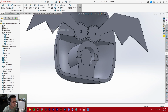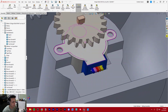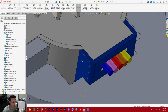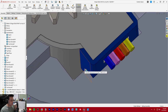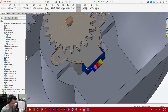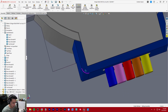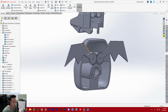So I'll explain in a bit more detail what was happening. There's this blue cover, right? In actuality, there's this weird corner here that's like an extra piece of material. And when I printed it out the first time, it was jutting into the plastic, and it wasn't fitting in the little recess we made for the stepper motor. So if you do that step, it should fit just fine, and then you still have enough wall to lock it into place.